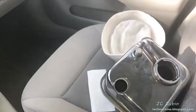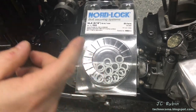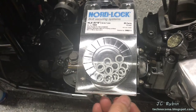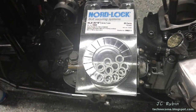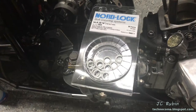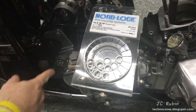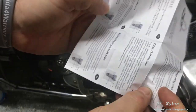The oil tank is now repaired — I just got it back from Jason. He did an outstanding job, thanks Jason. As I had previously stated, if I was able to get hold of the correct NordLock washers for this project I was going to do a test case for the transmission side cover before the end of this video. Somebody on the forum gave me the part number — this is for the 5/16, article number 1523. There is some discussion needed about their use because of how they function under a torque wrench.